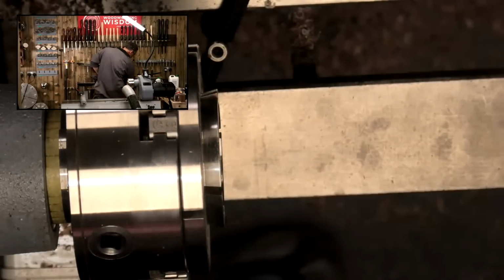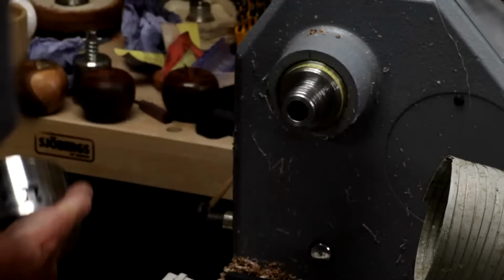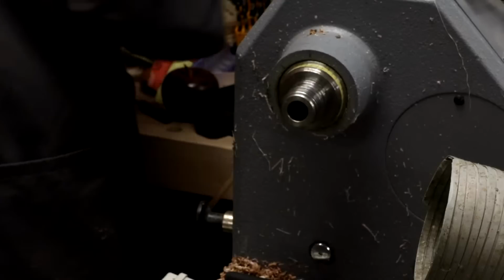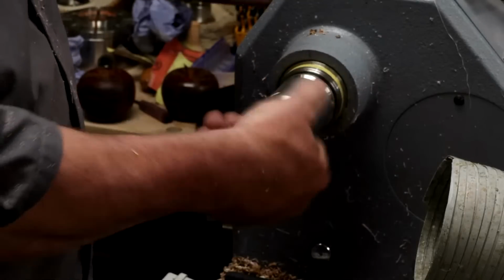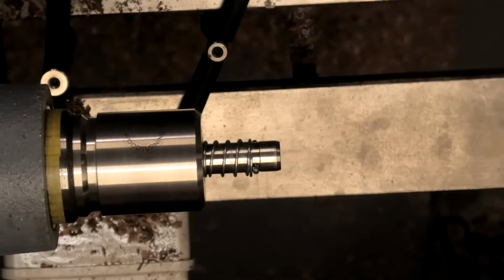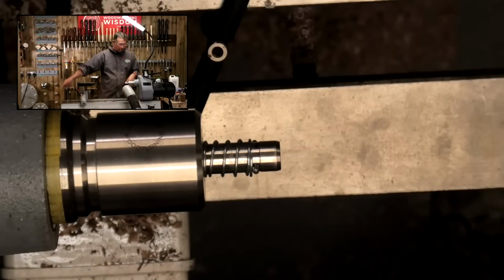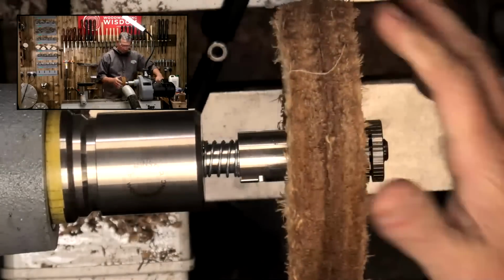Just going to do a little bit of buffing on the buffing wheel. Right, so I've got my buffing wheels here. Now, normally I'd be going straight over to the tapered pigtail, but like you saw Jason demonstrate last week, the twist and fix arbor. I don't do any carving or sharpening carving tools or anything like that, but for me it means I don't need my tailstock engaged. The tailstock can get out of my way now, and I can go straight onto the lathe as it's threaded with my preloaded mops.